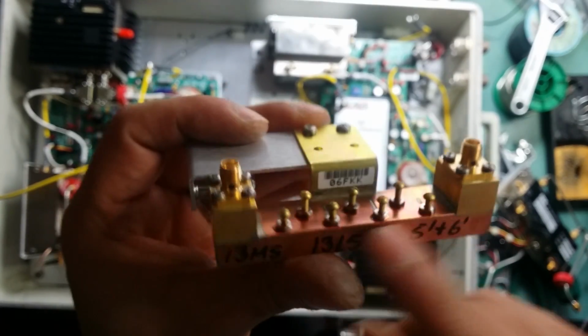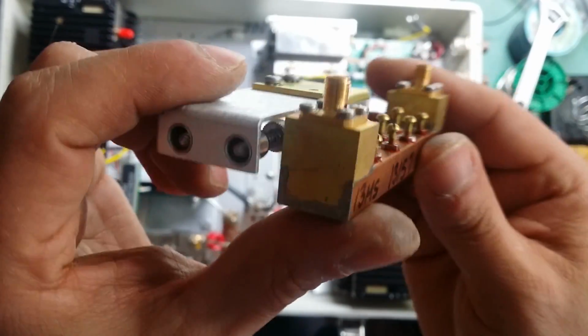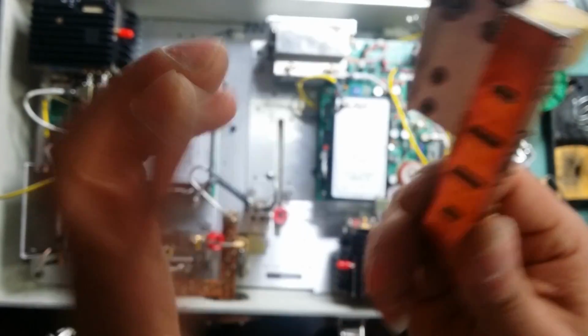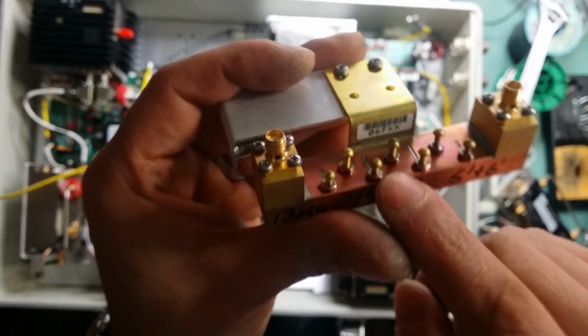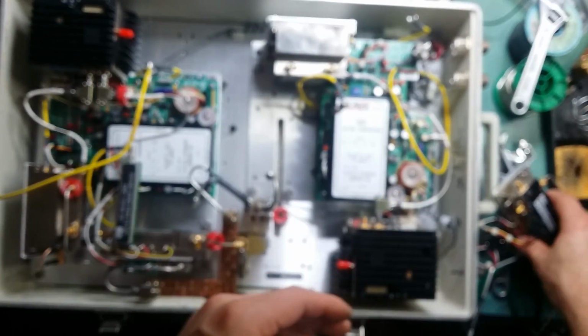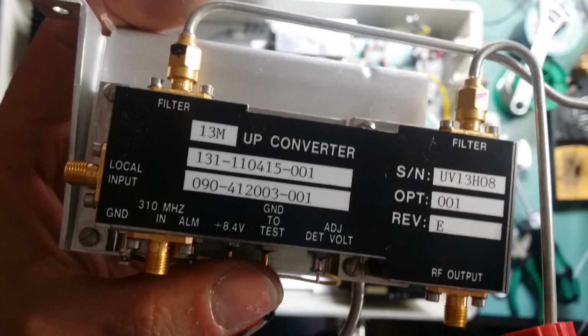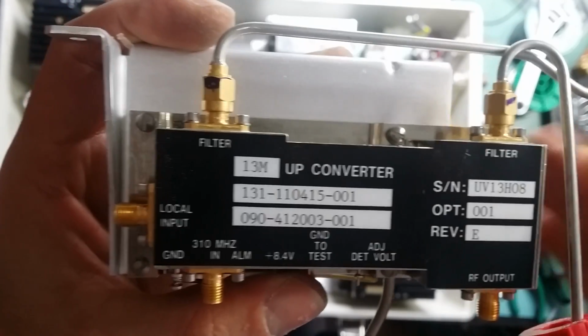And I had this kind of filtering with that 13 gig Nokia point-to-point link and voice unit that I took apart. They had a similar kind of filter on them. So yeah, at these frequencies they tend to use plumbing instead of normal filtering.